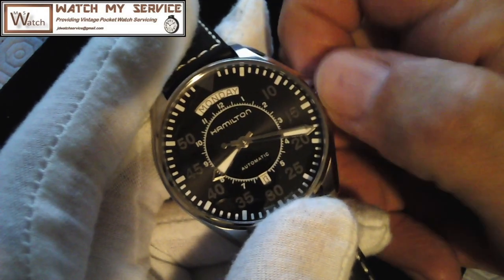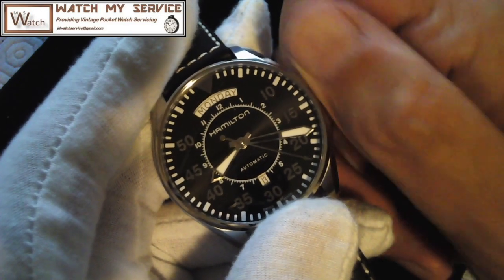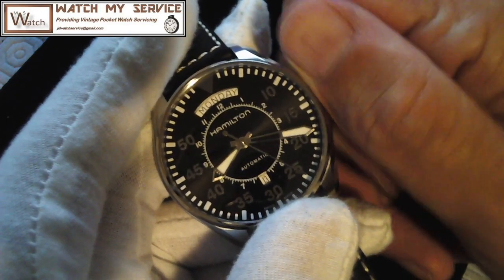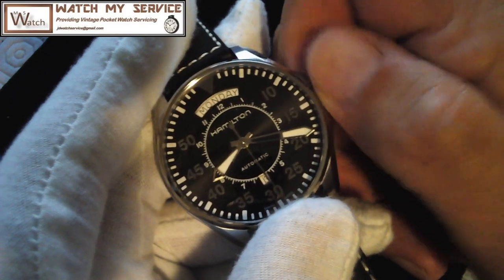The mainspring on this, there's no overwinding these watches because the mainspring on the inside of the barrel will slip, and there's barrel grease on the outside of the barrel. And I've explained that in some of my other watchmaking videos, how that works.